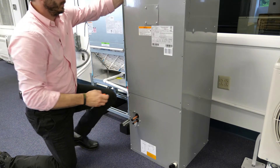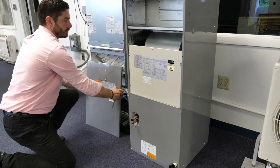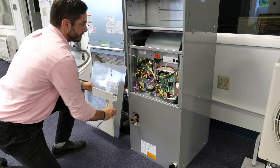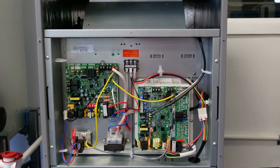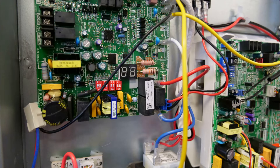The control compartment is located behind the upper cabinet door and has a cover that may be removed during installation and service to make wire connections and diagnostic readings. Additionally, there is a two-digit digital display for fault diagnostics. It is worth noting that, for ease of wiring, the board has been positioned upside down in the control compartment. Bear this in mind when reading status and fault codes as well as when setting any dip switches that may be required.